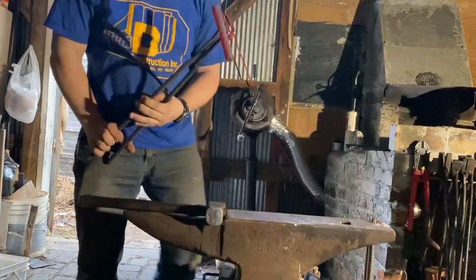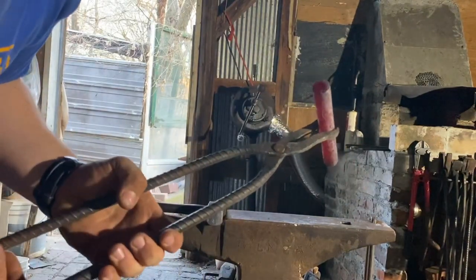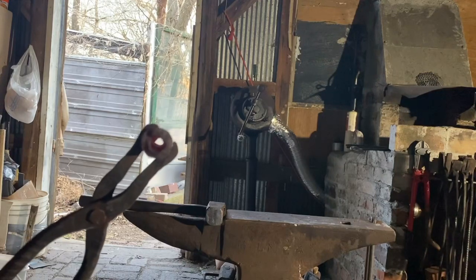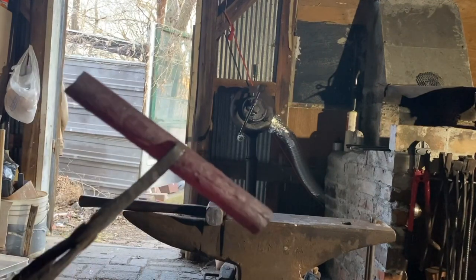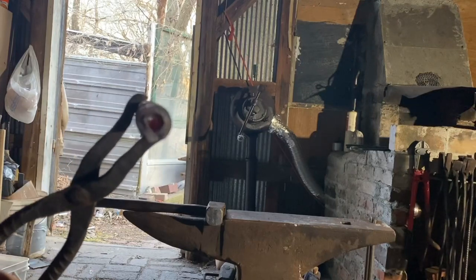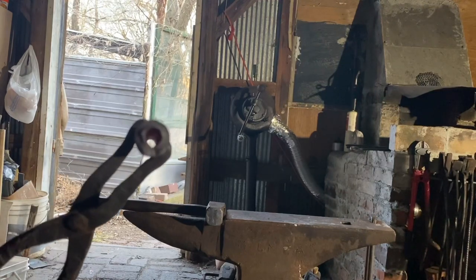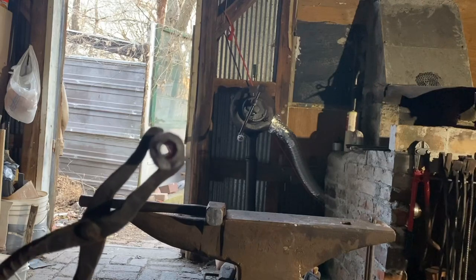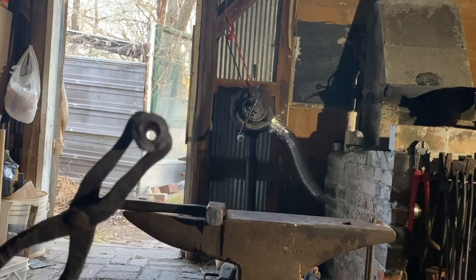That is pretty dang straight. Now we have about a 5/16 bore, that's about 8 millimeters. You can still see the seam — that's to be expected because the two ends were rounded. The inside looks very good. Since we made this around the 8mm mark and we only need to take it up to about 11 millimeters — 11.1mm, or 7/16 of an inch — we don't have much material that needs to be removed.